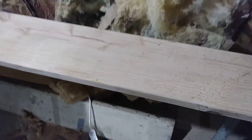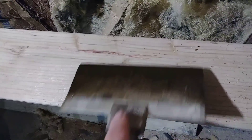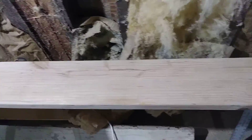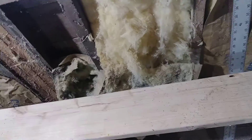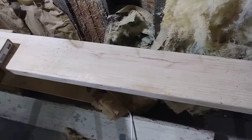You simply pour the glue out on the beam and then spread it around to make a full spread of glue across the entire thickness of the beam. The glue is going to give you the strength. You do not want to just place some strands of glue and hope it spreads. You actually want to spread it so that you have full contact between each layer as you're adding the layers.